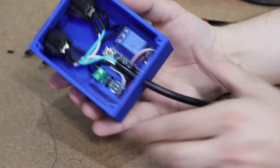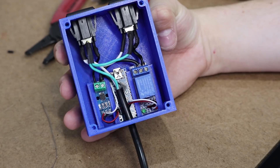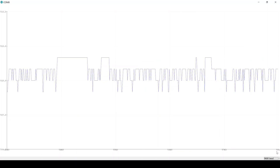Here is what the electronics looked like at this point of the build. Now it's time to write some code for the Arduino. The ADC pin on the Arduino has a 10-bit resolution, which means that it will read values from 0 up to 1023. Since the ACS712 is also designed to read alternating currents, the baseline value that the sensor reads when there's no current present is at the midpoint of 512. When I turn on the tool, the value alternates around 512.